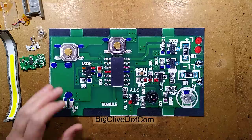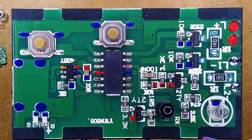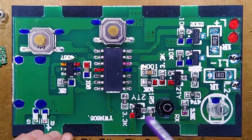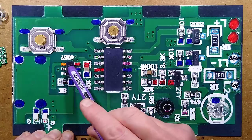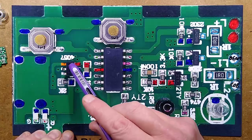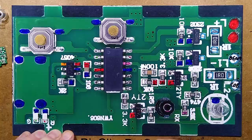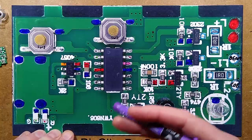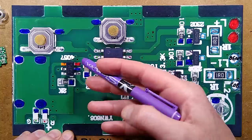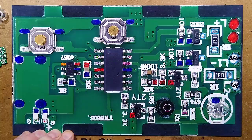The picture has been taken — let's zoom in and explore this circuitry. We have the USB connector on the other side going straight to this 17R chip, which is the charge control chip. It's got 4057 next to it, and the pinout does indeed match the TP4057 / LTC4057 — the generic mass-cloned 4057 charge control chip.